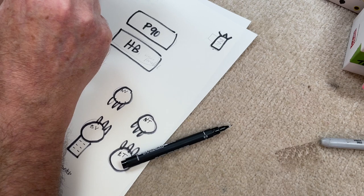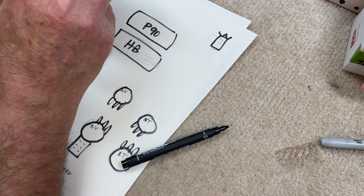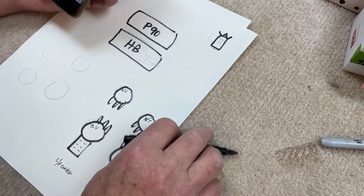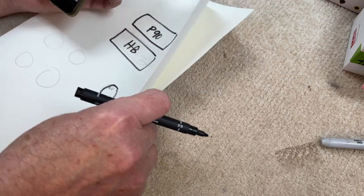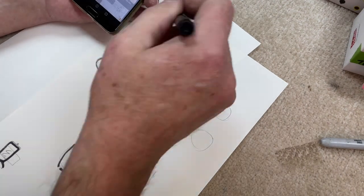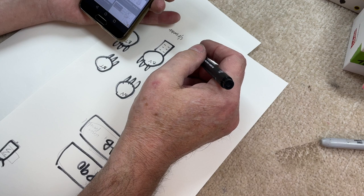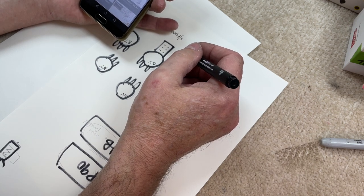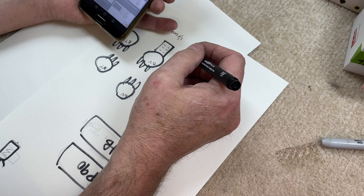Wiring for series parallel coil switching with a double pole, double throw push pull pot. That looks the business to me, but that is the volume pot that that one's on, but the principle is the same. So we've got it down here, and so we've got it upside down according to this. Well, let's do that first of all. And so what we've got here is the 5-wire humbucker, and we've got the red, white, parallel series. Yeah, up and down, we get that. So we've got bare and black. There's the tone. What goes to ground? So the white doesn't go to ground.